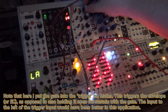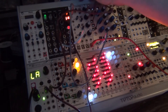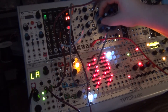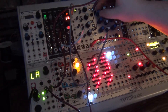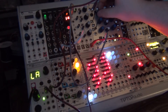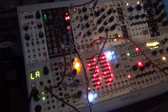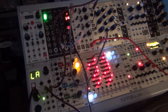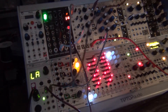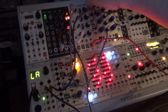If I turn this back up and adjust the knobs — turn this one down, turn the other one up — we're getting little blips. Now if I turn up the decay and turn up the rise, what's happening is that every time I hit a note it generates a sharp gate which triggers the Maths module to create an envelope shape based on rise and fall times, and that controls the volume knob on the VCA.